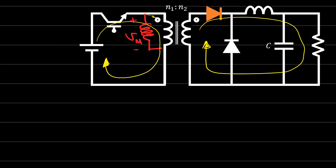This is in contrast to what we see in the flyback converter. Here we have two currents — at the primary side and at the secondary side simultaneously. At this point the transformer works as a true transformer, not as a coupled inductor, because most of the current going into the primary is transferred to the secondary.